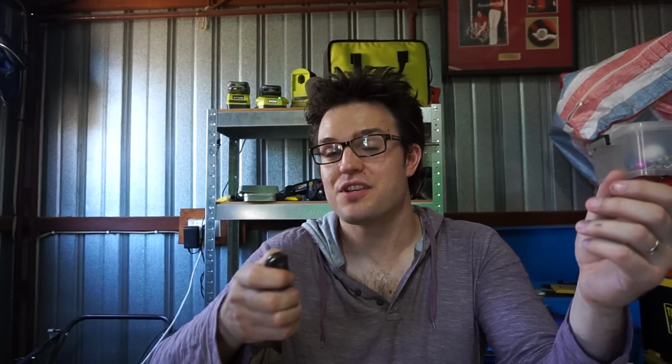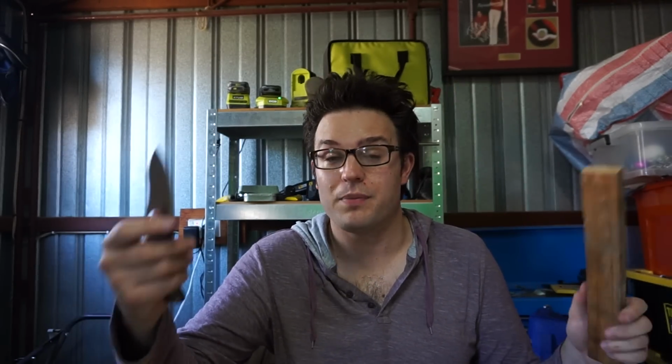So overall, I'm really happy with the steel for this knife. 260 cuts with a pretty easily done edge. I know it took me shorter time because I have a KME, and I'm lucky that I have a KME, but 1500 grit's a very available bench stone, and just a strop compound on even this leather belt. It's just a matter of time, you'll be able to get the same result with a little bit of training or with a bit of equipment.